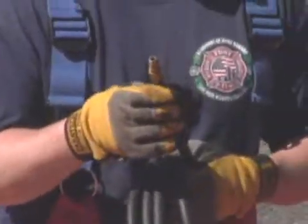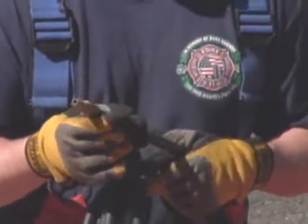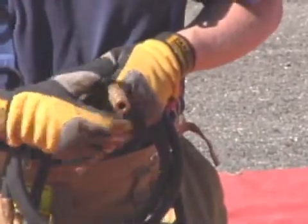Our hoses are reinforced rubber, 3/8-inch diameter, high-pressure hoses. They operate at 300 psi and come in various colors and lengths. The couplings are snap-locked with a twist safety, with a 4-to-1 safety rating.